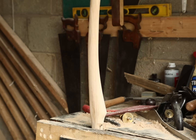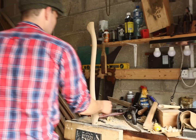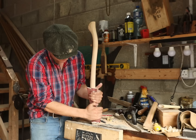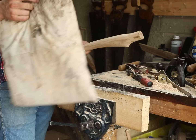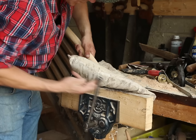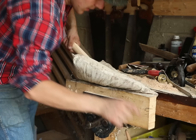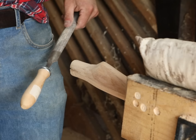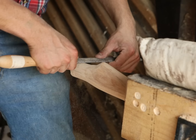Here's how the handle looked once I was finished with the rasp — time to move on to sandpaper. I have some 60 grit here folded over on itself for a bit of strength, and I just rub that up and down the shaft removing any imperfections or cuts that the rasp made. My shave horse is out of action at the minute so I'm using my bench vise. The jaws of the vise bite into the round shape of the axe, so as a solution I found an old pillow and shoved that in the vise first, then placed the handle within the pillow to stop the jaws from leaving ugly marks. I also have a bastard file here — a file with a flat face on one side and a round face on the other — which is very useful for shaping the parts where the head actually slots in.